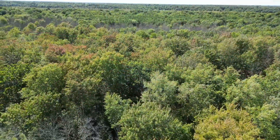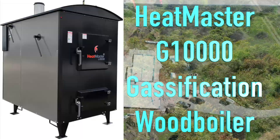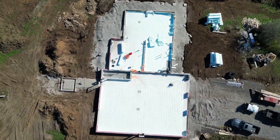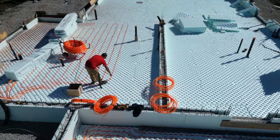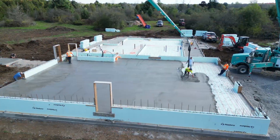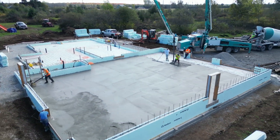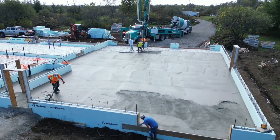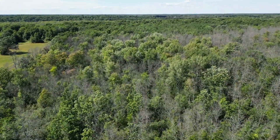It's something I've never done before — I've never had an ICF house build before, so we're learning a lot. The other unique thing about this homestead is it's going to be heated by an outdoor wood boiler with in-floor radiant PEX tubing under the cement floor for the main floor. For the second floor, we'll have a propane-powered forced-air furnace if we find it's a little cool up there, but that runs off propane rather than solar, so I hope to avoid it.